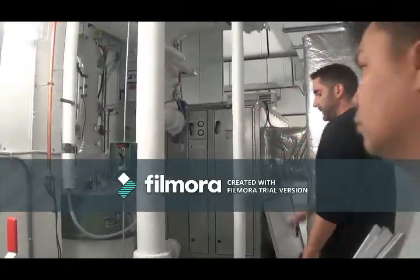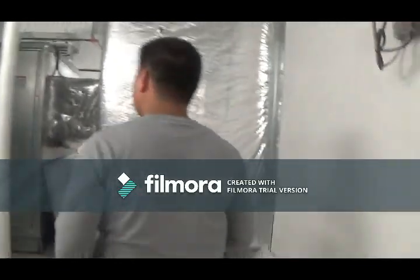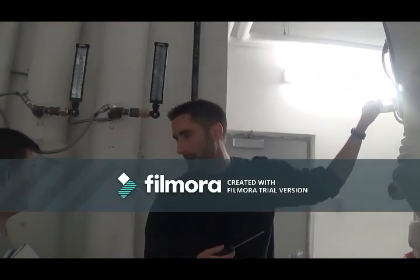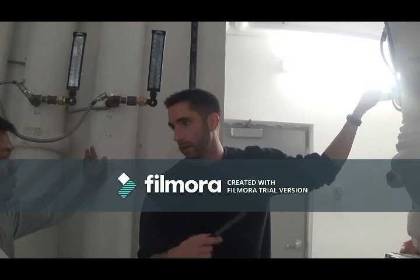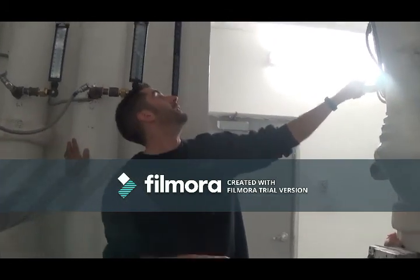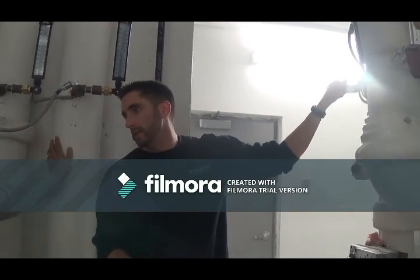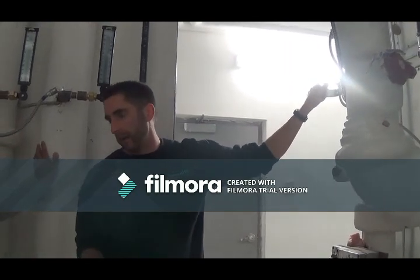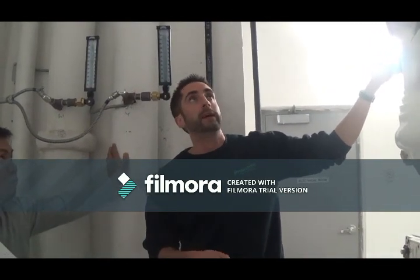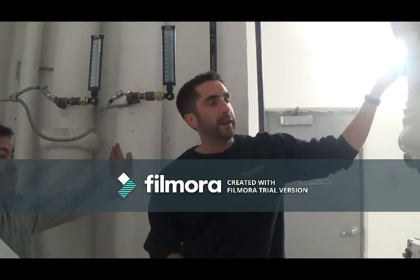Then you have your VFD. On the VFD, we control the start, stop and the speed. So if you ever wanted to speed up the fan, if you find you don't have enough ventilation in the corridors, you can call us and we can increase the speed. Yeah, never hurts. If you have some people that smoke in their suites or getting cooking odors or anything like that, we can always speed up the fans a little bit just to keep it out of the hallways.